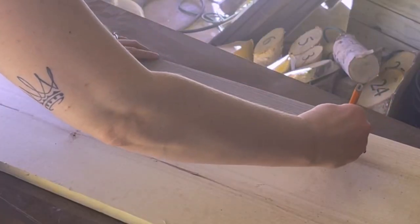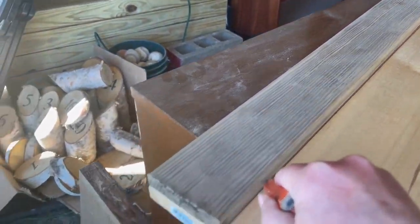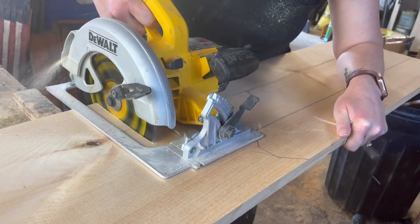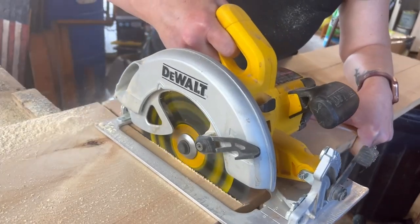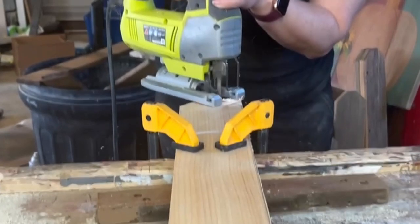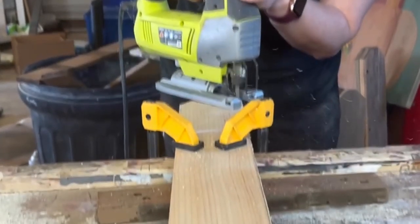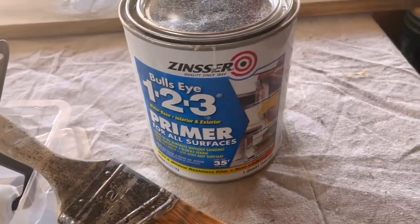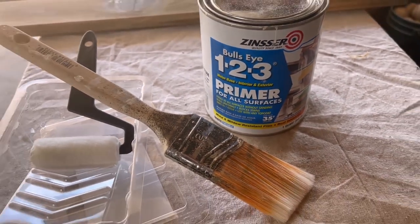Since some of my boards were really ruined, I eliminated what I could, but I really wanted to replace at least one of the fence posts so I could have three on each side. I had a piece of scrap wood in my garage that was the perfect width of the original fence posts, so I traced out one of the fence parts and cut them down with my jigsaw. Now we can finally move on to priming.